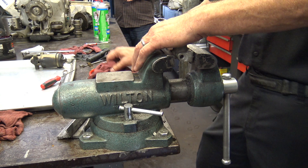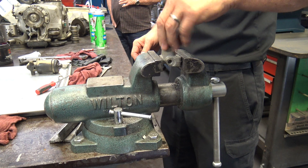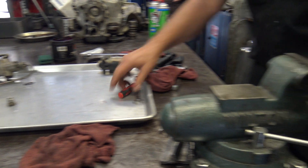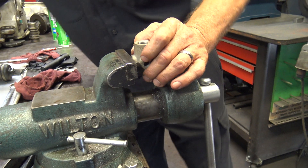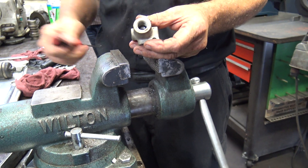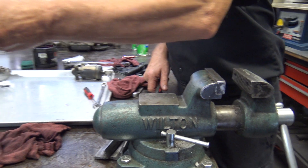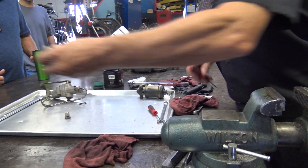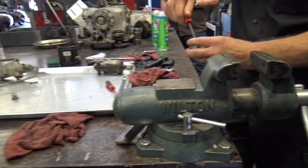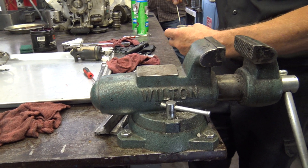There's not much in this valve here at all — you'll be surprised. And there are two of them, remember that. You've got this big tapered fitting, you've got a little O-ring in there. And this is actually a good picture — if you look in there, it looks like some garbage in there, right there in the center. Little pieces of rubber almost. And that's where you can run into problems. Once I get it apart, you'll see that those tiny bits of rubber, as small as they are, can cause a lot of grief.